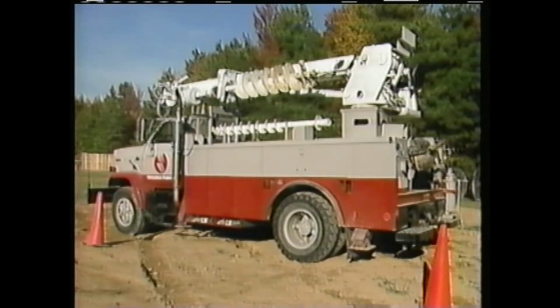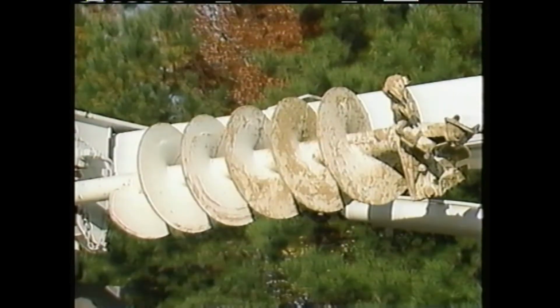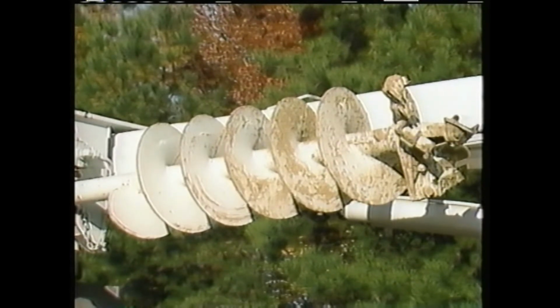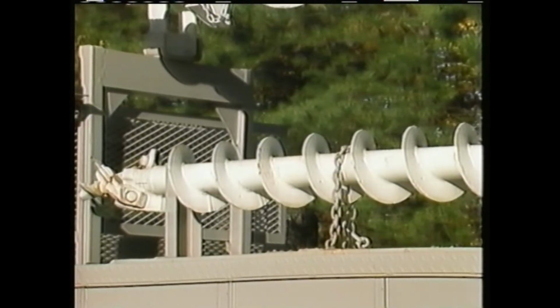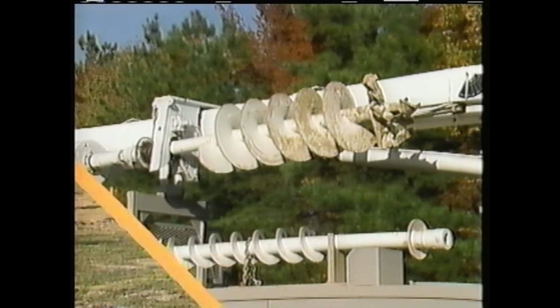This digger derrick has 2 augers, a larger auger installed on the digger mechanism and a smaller auger stowed on the truck. The larger auger has a diameter of 18 inches, which is just a little larger than the ideal diameter. The other auger is clearly too small. Since the larger auger is close to the size needed, he will use it to dig the hole.